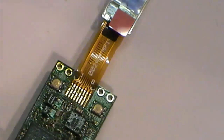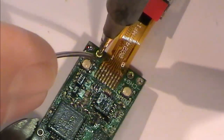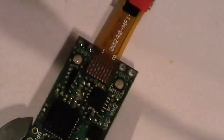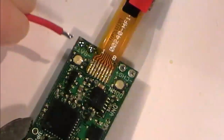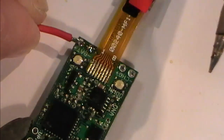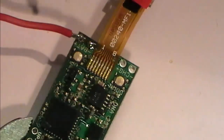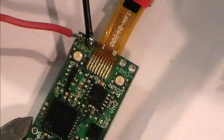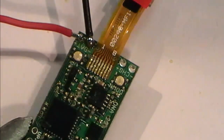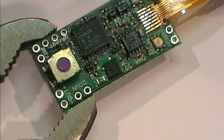And I need to bring in my battery holder. For some reason my tin isn't taking in there, so let me get a bit down in. There, so I've got my positive and my negative for my battery terminals. As I say, I'm just tacking these on the top for now, just to prove my board out of the box. I've got a bit too much solder on there, I don't want that much. Again, this looks ropey soldering, but I will be taking these off again just to prove them outside of the board. Now what I've got down in here, I'm going to add just a couple of little switches.